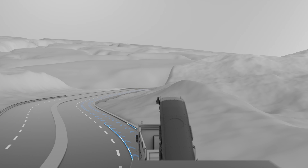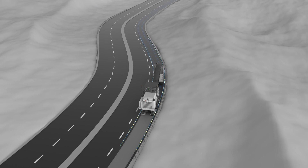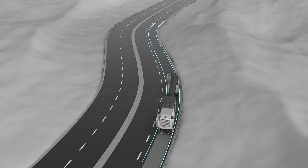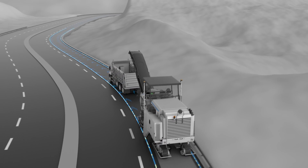With the limitation of a sonic averaging system removed, independently adjust the virtual ski on the left and right of the machine up to 100 meters along the centerline. The system automatically compensates for roughness even further ahead on the surface, providing tailor-made parameters to fit the application and customer needs.